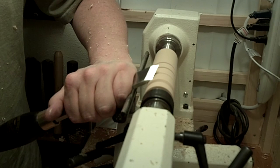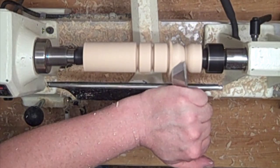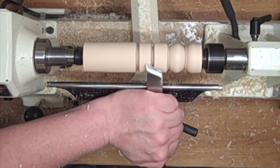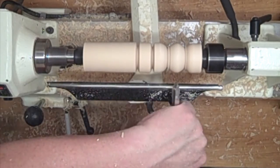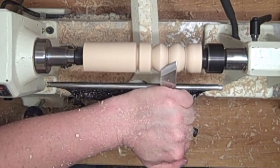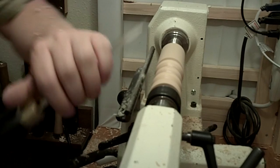Here I'm starting to do my beads. I'm riding the bevel but the only part that's touching is the very toe of my skew and I'm riding it around. Now I'm making a mistake here — notice that I'm pivoting on the tool rest. I really should not be doing that. You're supposed to slide and keep that skew at 90 degrees. Because I pivoted, that one particular bead is kind of pointy and flat — it's a bad bead. Here I'm doing a little better job: I'm sliding on the tool rest, keeping it 90 degrees and just rotating it around. Don't worry about being too perfect because you can always sand it smooth.